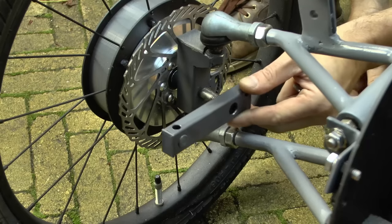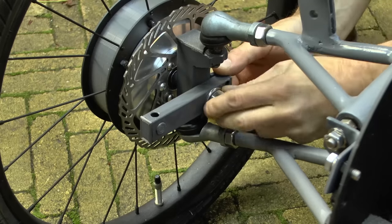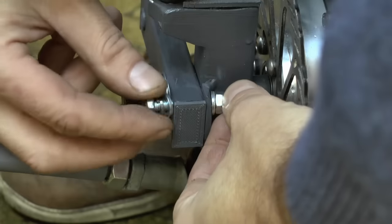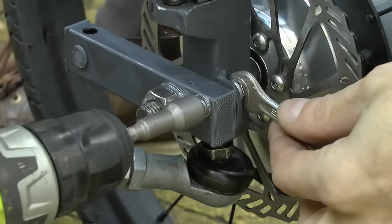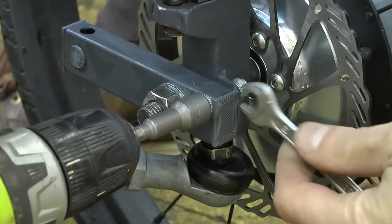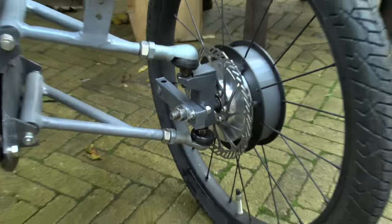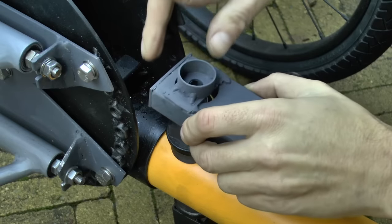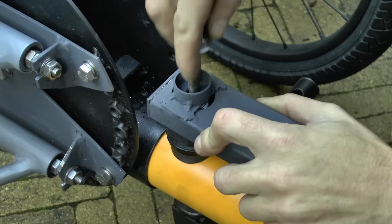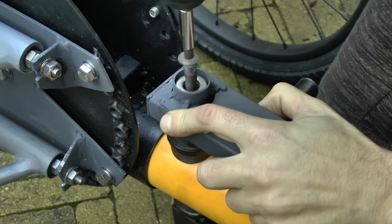Yeah, and after some finishing with paint, let's put that in place. Yeah, that's the adjustment to the bracket so that I can change the angle of the position of this arm when I change the angle of the caster. Yeah. That looks good. This part will interface this steering pivot with the wheel steering links that we just saw.